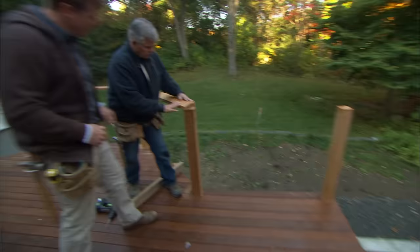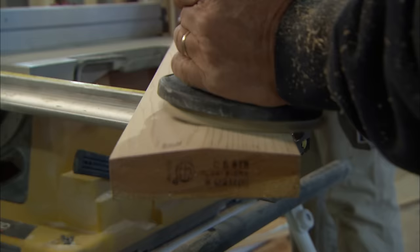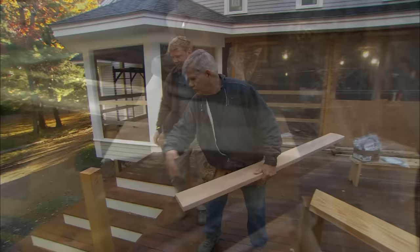I actually have to cut a couple of slots in it for floating tenons. To get the bevel on the top railing, I'll set my saw at 8 degrees, then run the piece through two times — that will get me a point at the center. I'll fine-tune the rough cut with sanding. This is a 90-degree corner, so that's an easy angle to get.